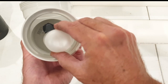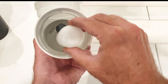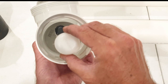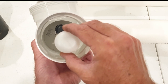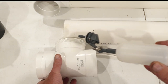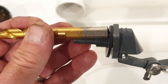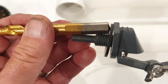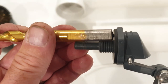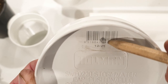When figuring out the right height of the float valve, take note of where that water inlet is on the end cap — that gives you an idea about where to drill the hole. Looking at it, I'd say about a centimetre from the top of that end cap. To work out what diameter drill bit to use, just line it up against the thread of the float valve. I've marked it to be about a centimetre from the top, so that's where I'm going to drill the hole.